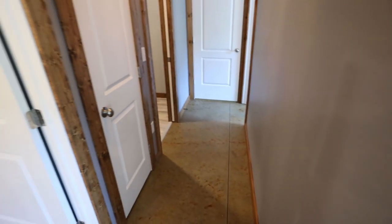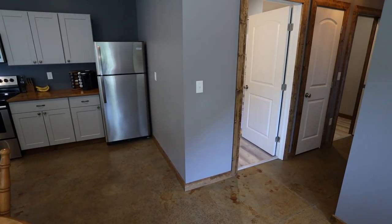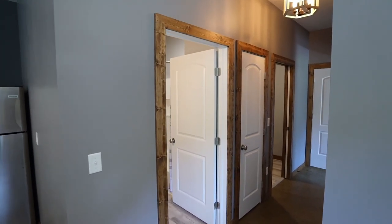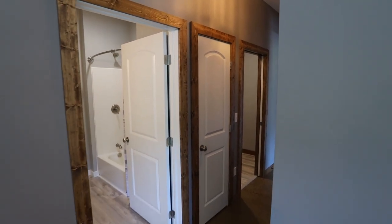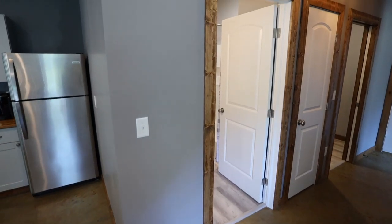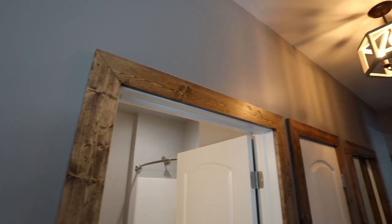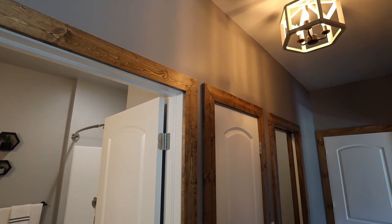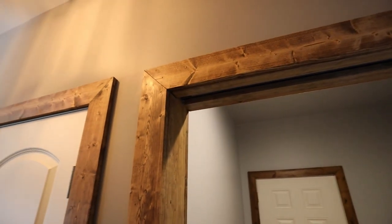And then for outside, to match the rest of the house out here, I did the stained and polyurethane trim. So like I said, there was a lot because of all these doorways, and there ends up being a lot of wood in this hallway, but I do like the way that looks. And I did take the time to go around and fill all the holes with the paint-matched putty that Minwax sells. So that looks a lot cleaner because you don't see those little nail holes, and from where you cut, you can clean up sections that maybe tore off for a really clean finish.